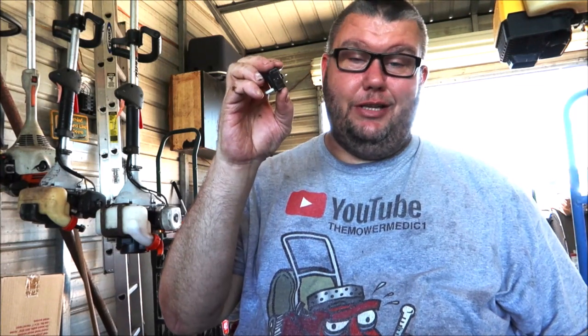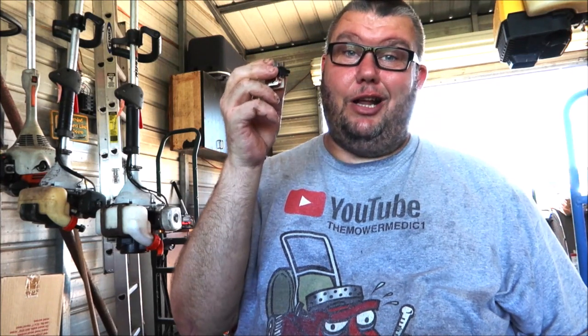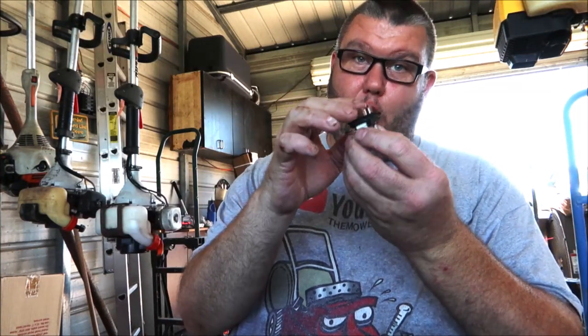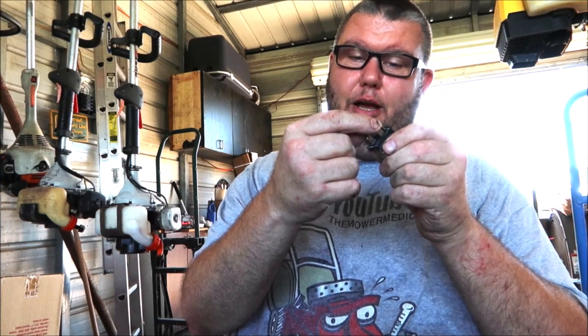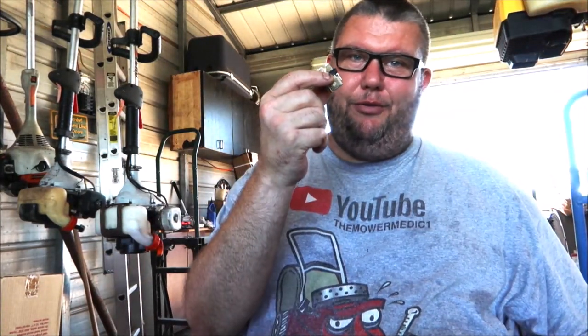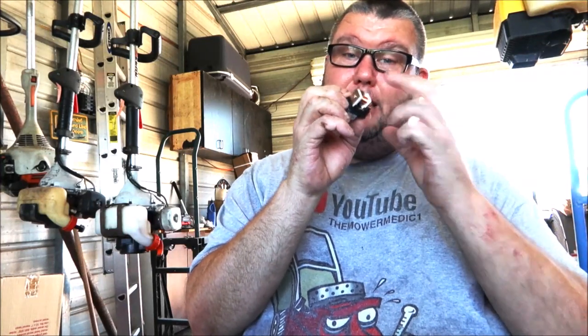They're used for high-amp loads such as a tilt-and-trim motor in an outboard motor. I've seen these in starting systems and especially in electric clutches. You just take a light load, energize this coil, and it creates a path for your higher-amp load on the thicker terminals — these two outside terminals — allowing you to run higher-amperage devices like a motor while keeping other electrical things from getting burnt out. This will be your sacrificial piece; these are cheap, like three bucks, and they do fail — mechanically and electronically. If that coil or electromagnet goes bad, you're dead in the water.